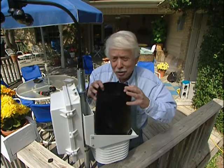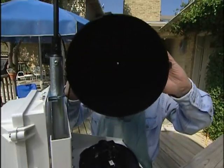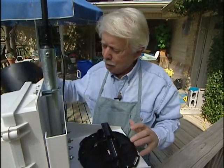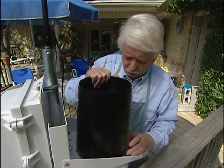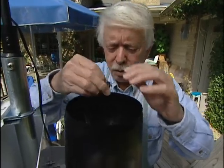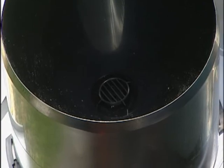This container is our rain collector. The water falls in and goes through this little hole in the bottom, falling down on these buckets which alternate back and forth to give us a very accurate reading. You might wonder what happens if you've got airborne debris floating around — wouldn't it clog up the rain gauge? That's why there's this little strainer here. Put it down in the bottom to cover the hole and no debris gets in to foul up the rain gauge.